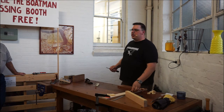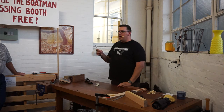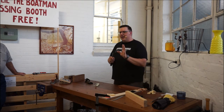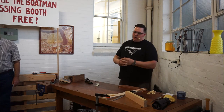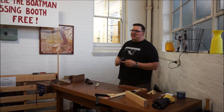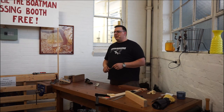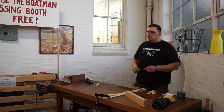The old boys used to just use a screwdriver, but they don't make screwdrivers anymore with hardened shafts — the tips are hardened. The old ones used to be hardened right up the shafts, so you could use those as a burnisher. Don't try it now though — what you'll do is end up with a screwdriver shaft that's got a bunch of marks through it. So all your burnishers have that teardrop section — you always want a highly polished burnisher so you don't abrade any steel. You don't want a rough finish on a burnisher; these ones are finely polished so they're nice and smooth.